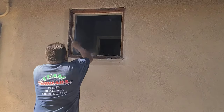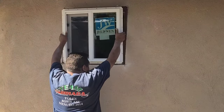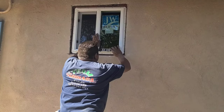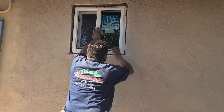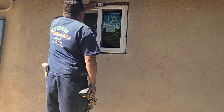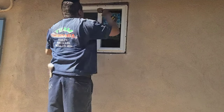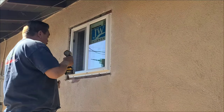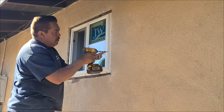Okay, let's go ahead and install it and put it right in the center. Just about to get one started. Make sure it's level. You run a few screws, square it up, then open the window. I like using this new construction style rather than the retrofit.